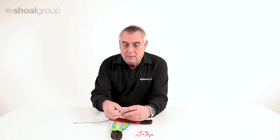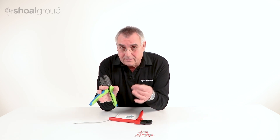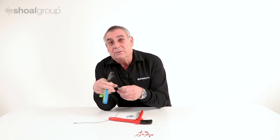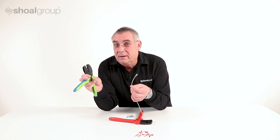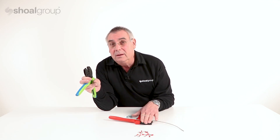This termination, if calibrated together, is capable of meeting the highest standards that are possible in the marketplace today. We could apply this terminal with this tool, and this would apply the terminal to the wire as well. The difference would be that this would probably not be able to produce the pull-off and millivolt values that a completed termination with this tool would produce.